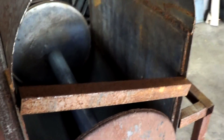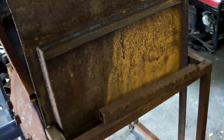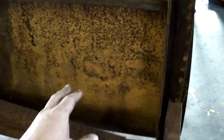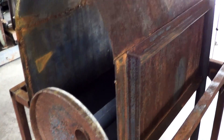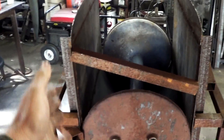This is one of those projects where I haven't touched it in so long I had to look it over and see where I was at. This is a retort kiln, or the start of one. I started with one water heater — I cut it to length, split it, straightened out the leftover half and turned them into the sides, so I didn't have to buy any material. It's probably not the best way to do it but I'm just working with what I had. It's mostly an experiment at this point. If I build a second one I'd build the housing and firebox out of masonry.